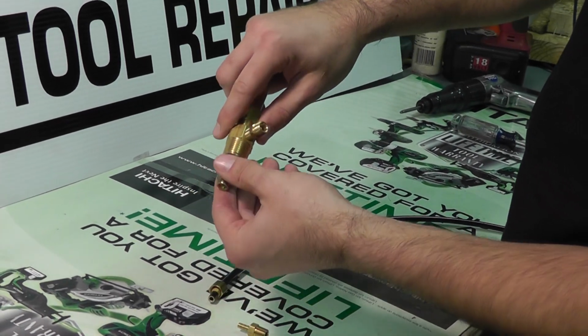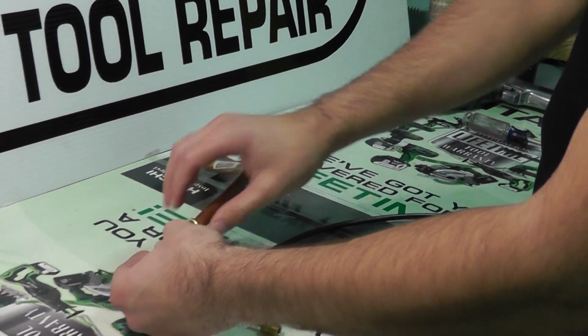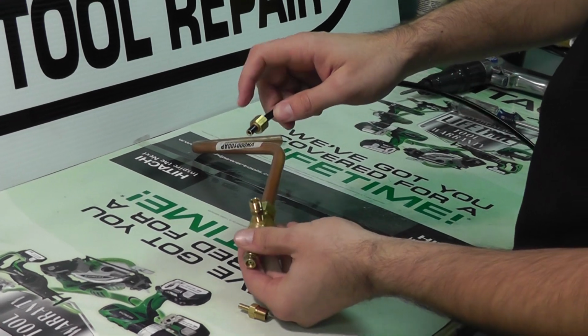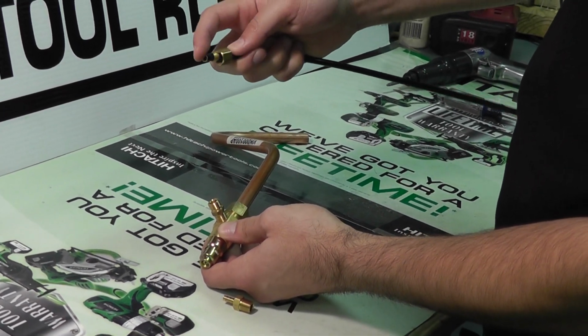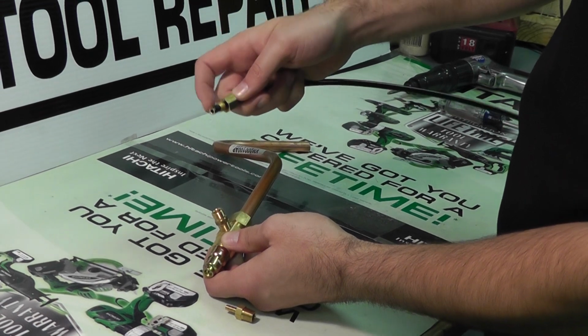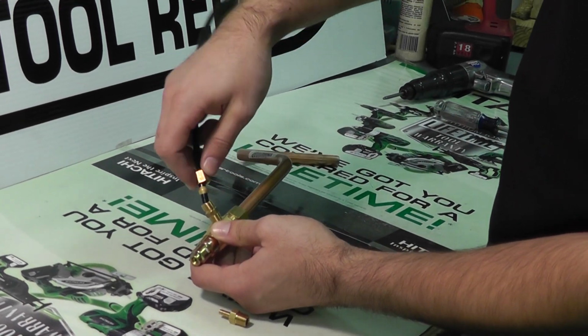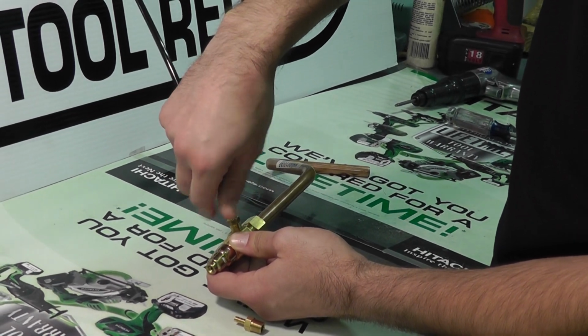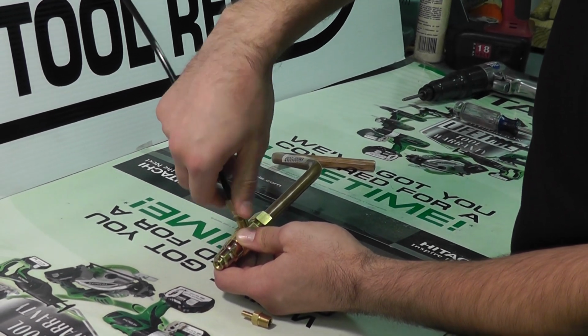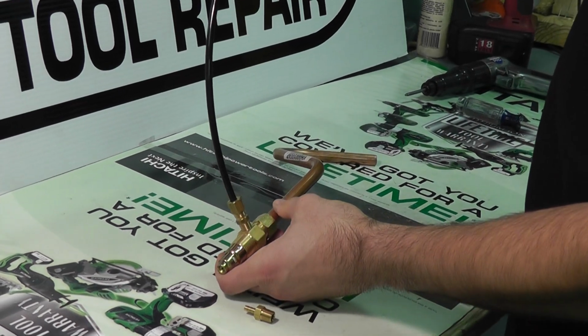They'll function the same. Alright, so to attach the unloader line to the adapter, you have your 1/4 inch compression nut and sleeve and your tubing insert. This brass insert stiffens the end of the tube. Simply thread it onto the compression fitting, and voila, there you go. You have your unloader tubing and your discharge tube.